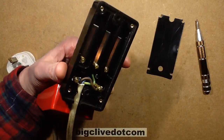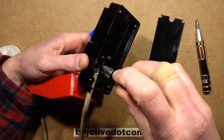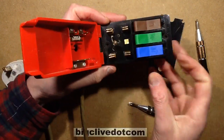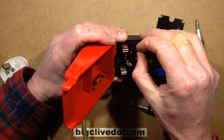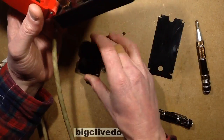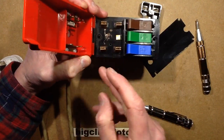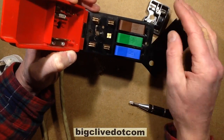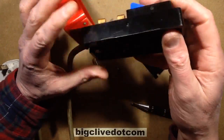Let's actually open it further. Inside we've got the neon indicator and we've got the receivers for the knife switches - the sockets of the knife switches - so that as the knife blades come down, they go into them. As you can see, when this is open, even with this design with the separators, there's really good physical separation between these. Even a bit of loose metal finding its way in would not bridge them out very easily - you'd have to have some really major misfortune for that to happen. So good isolation inside, and underneath as well, really good separation between the input and the output.